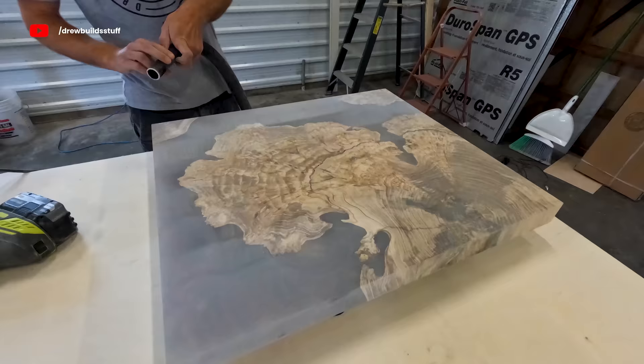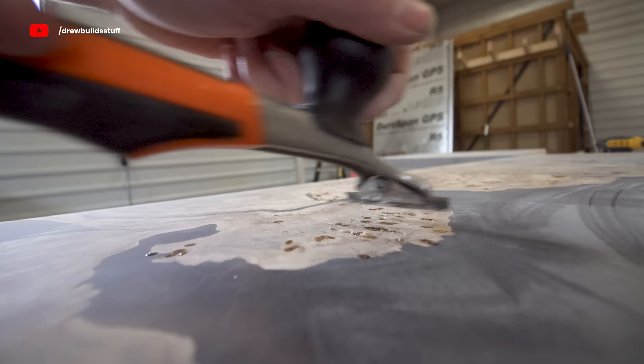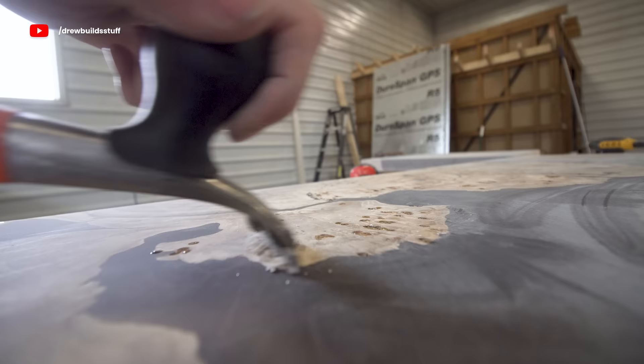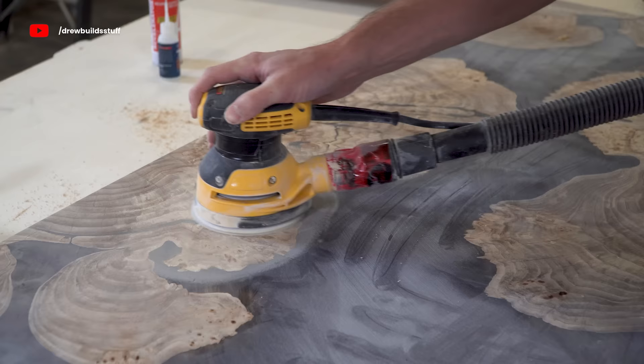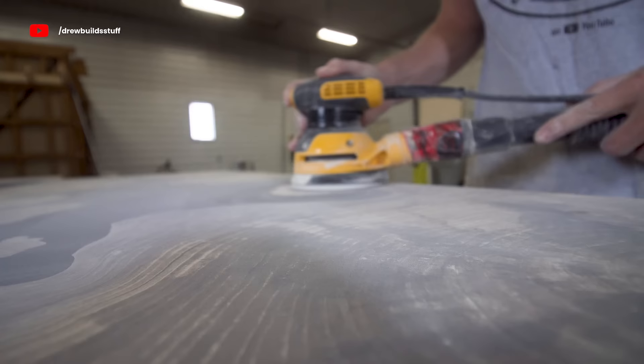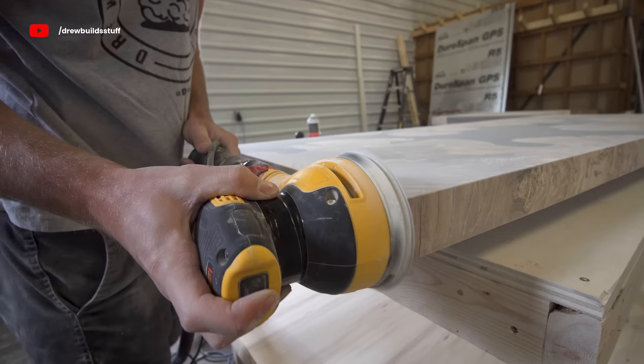I spent a good amount of time making sure I got every little gap and crack, and then I used this block hand planer to take off the CA glue as much as possible before sanding over the top. I use the hand planer to take off the majority of the CA glue and then let the sander finish it up, mainly because if I sanded down the whole thing it would take a lot longer and cause an inconsistent finish — you'd be sanding the wood at the same time you're trying to get rid of the higher CA glue part, ultimately causing some distortion and non-flatness.